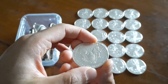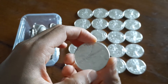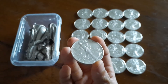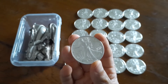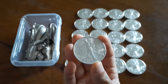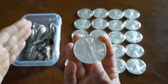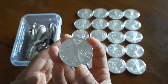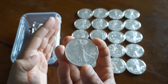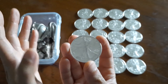Once the coin is stamped, it is usually washed, then packaged and prepared for shipping. To summarize the extraction and minting process from ore to coin: you start with rock, pass it through a cyanide bath, precipitate your precious metals out, and get a mixture of gold and silver called doré. The doré is sent to an assayer mint, which performs the parting process of purifying the silver and the gold.